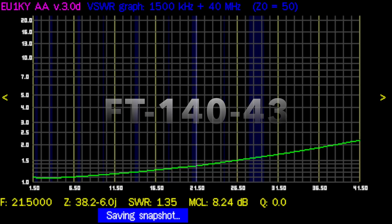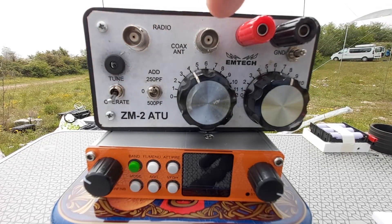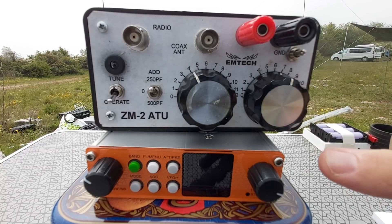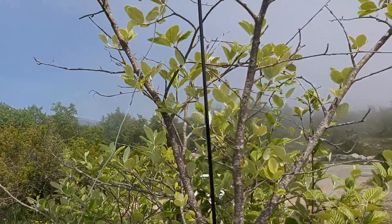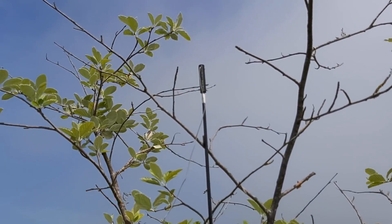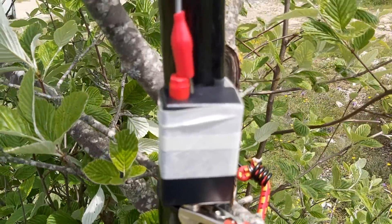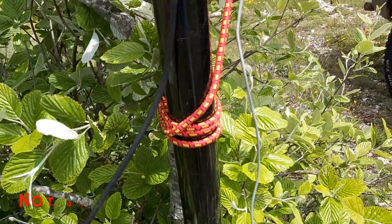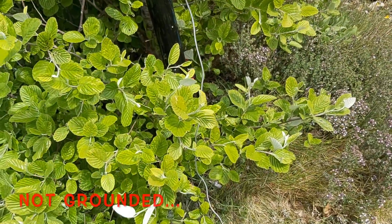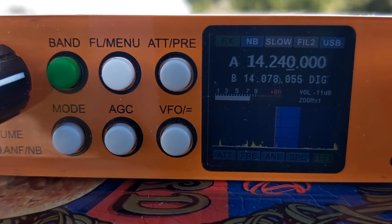These graphs don't show how the UNUNs will perform in the wild, which is why we're doing these field tests. I'll be using the ZM2 tuner — I like it because of the 50-ohm bridge, so I won't damage the radio, which is the Minion SDR. Here's the spider beam at 12 meters. I'm probably not going to use the full 12 meters. My 8-meter wire is attached to the top. First up is the 9-to-1 with the T106-2, and I have a counterpoise a little longer than two meters.